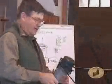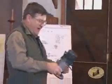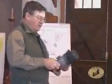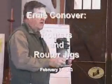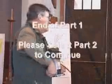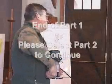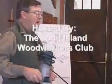You should form the habit of always holding the router the same way, and a router is usually meant to have a certain side towards you, and for this one, all this is here, and the switch is conveniently located and so on. And you shouldn't hold it backwards in the jig or anything like that, because you're now sort of exacerbating that problem. By holding it the same way, at least you'll keep the error constant.